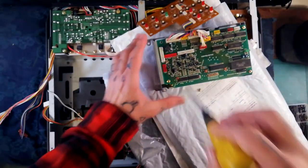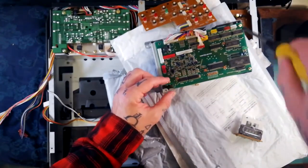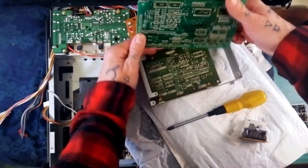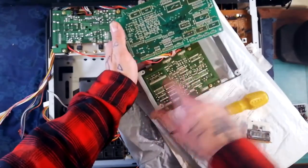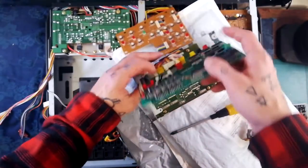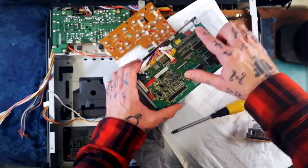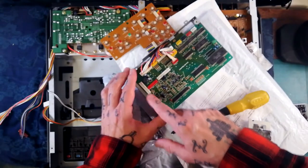To access the rear of the control boards, Control Board A is attached to Control Board B from the top of the cassette via four screws. With one already removed, I'll remove the other three — one, two, three — and that will fold back like that. You could detach all those cables at that stage if you wanted, but this gives you access to the underside of both boards if you need to solder anything there.